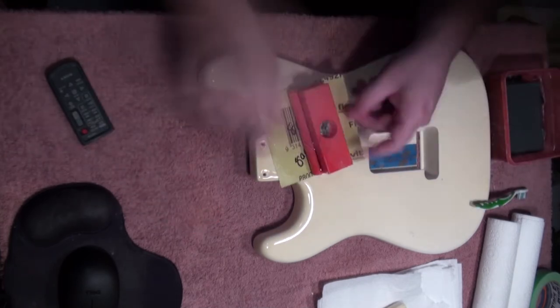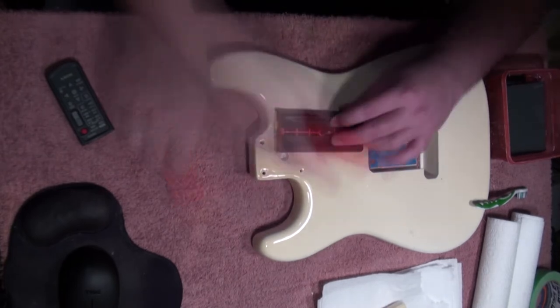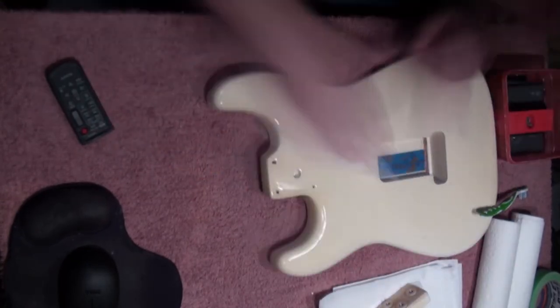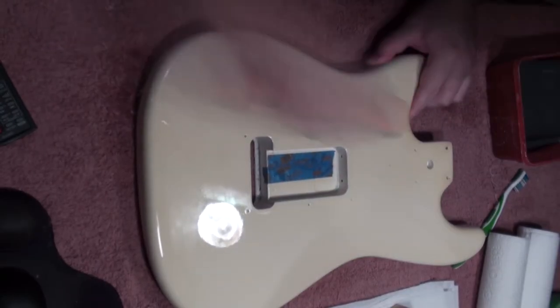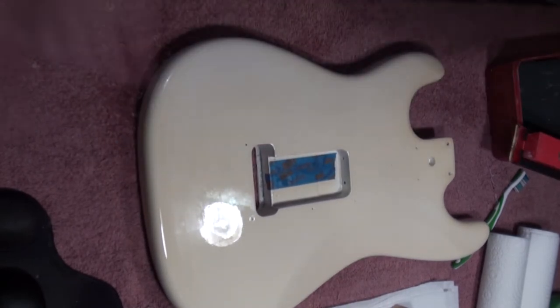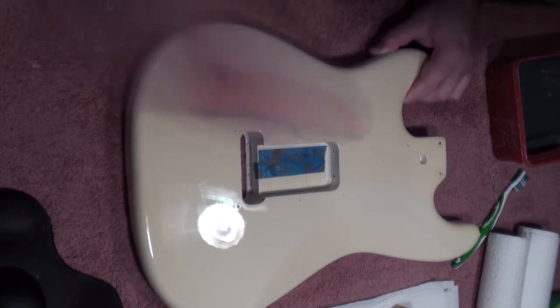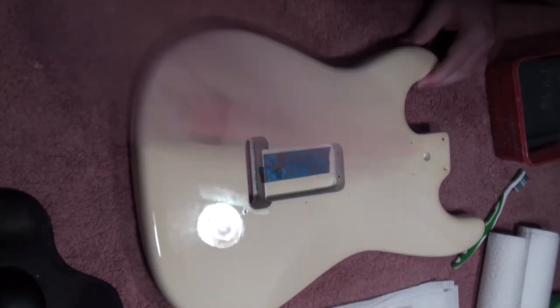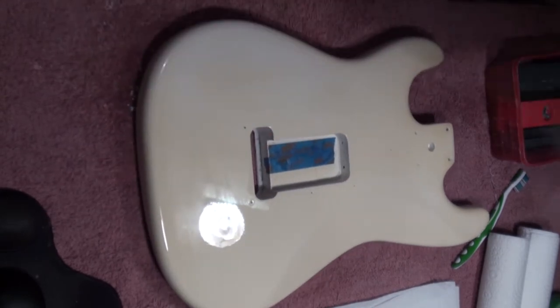This would have been quite a short wet sanding session, as there was very little orange peel or unevenness to the finish. If you want to see a really good example of what the wet sanding process actually does, there's a video on my channel about wet sanding from when I added the clear coat to the Sunburst project with a paintbrush. This is why it's a good example, because you can actually see the difference as I go through the different strengths of sandpaper, from harsh to fine, and sand back what I call hills to level the surface down to the bottom of the valleys. On this guitar it was still required, however on this round of clear coat there was very little orange peel to deal with.